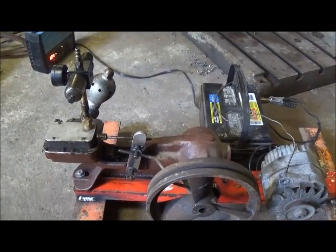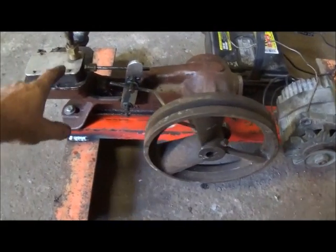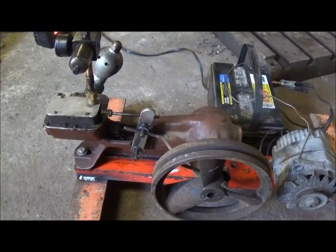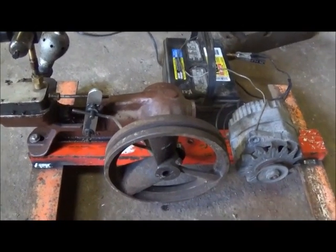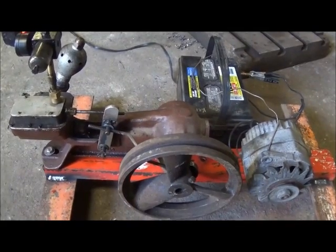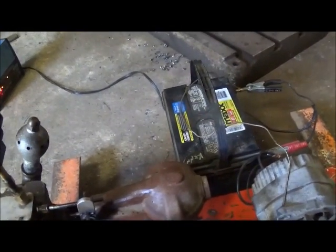It's a double compound — just a simple setup. I've actually got a piece of oak wood in there that slides back and forth, concaved in the bottom to cover the valves, to do the slide valve. Works pretty good. I'm going to let you see it run here real quick before I hook up that alternator. I'm running it on air — I don't know how it would do on steam, this has never been run on steam before.